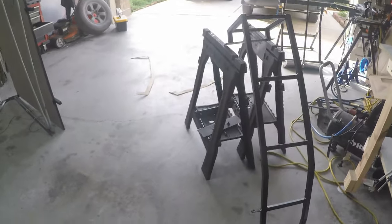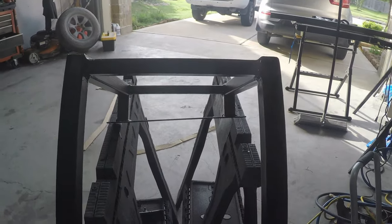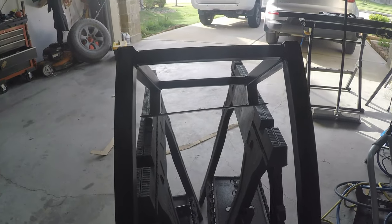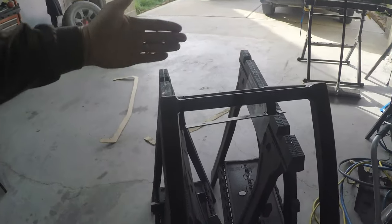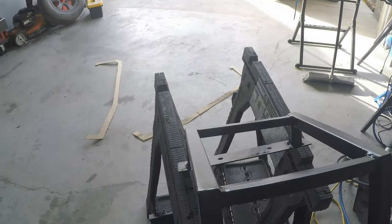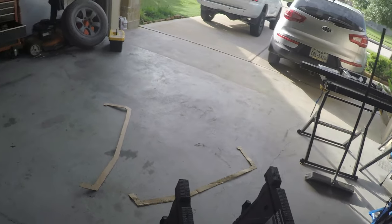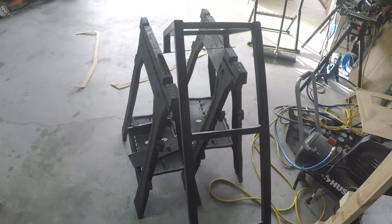One quick tip: you can see the difference in the angle at the top — this side of the roof is a little longer here than there. Make sure when you're putting the rungs up, you're not making this one exactly the same as that one. I just get a torpedo level and put it on there to make sure I've got the height properly set. The very ends of your ladder rungs are going to be different on each side, similar to the bottom — so keep that in mind.